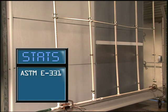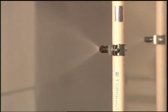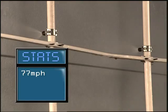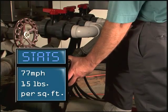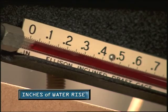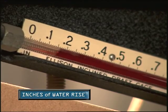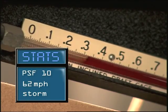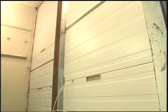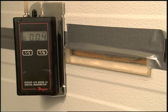This standard requires the spray heads to be calibrated to 5 gallons per hour per square foot. By varying the negative pressure, we create conditions comparable to rain and wind up to 77 miles per hour, which is equivalent to 15 pounds per square feet of pressure. In this particular test, the pressure inside the chamber is lowered from 0 to 10 PSF below the outside pressure until the joinery begins to drain water through breaks in the air seal. The maximum PSF of 10 is equivalent to a 62 miles per hour rain storm. Inside the test chamber, we can view actual conditions within the panel joinery and the back of the wall. The digital gauge indicates the actual pressure being applied to the joint in inches of water.